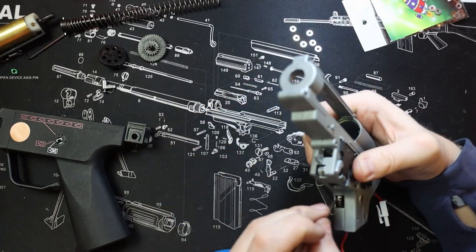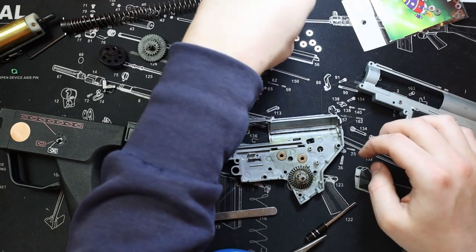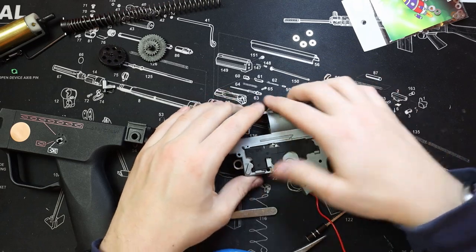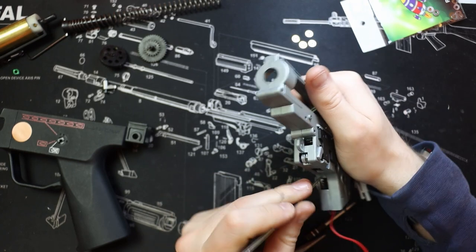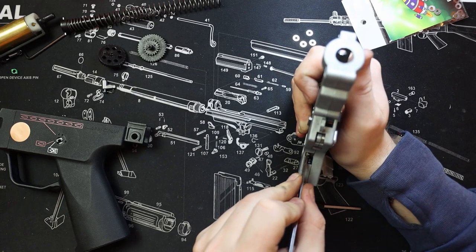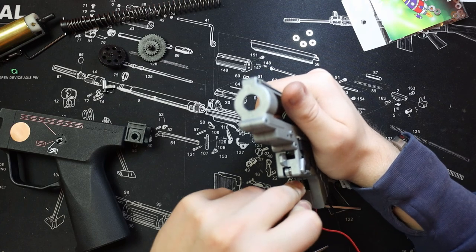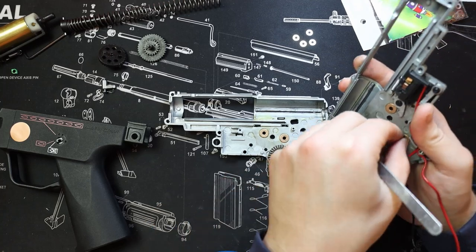With the case hand-held closed, I'm using a pointy stick to check play — that's still about a millimeter of play, so we'll add more shims. I could add them on both sides but for speed you can just add them on the top and move them around afterwards. After closing up again and clamping down, it's getting quite tight — that seems a bit too tight. So I'm going to take that last 0.2mm shim off and put a 0.1mm brass one on instead.